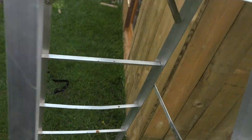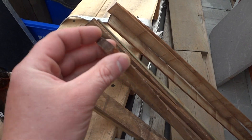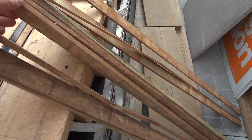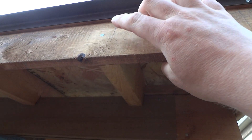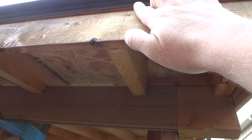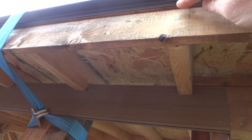I'll show you the wood I'm using — these are pieces from Home Depot used to separate fence boards, all pressure treated. This one is about three-eighths inch thick, which is even better. Ideally you want about half an inch — you put it right to the fascia and it separates the drip edge from the wood, so water drips away. They've tested this: at half an inch it drips away from the fascia instead of being drawn back by surface tension.